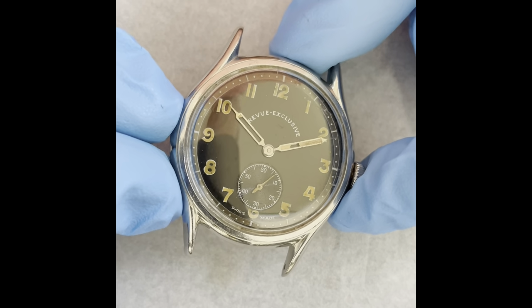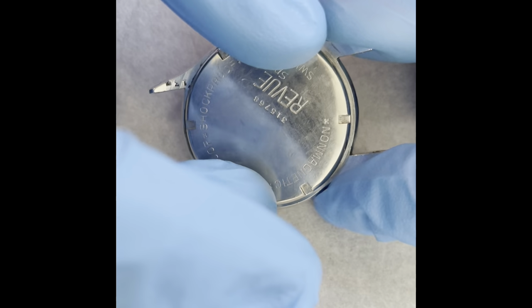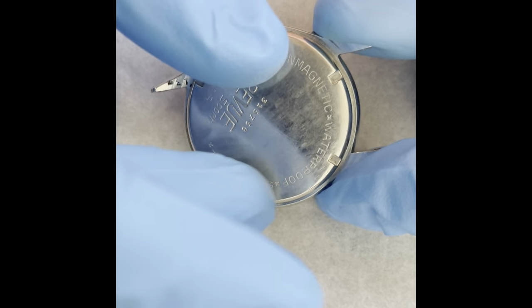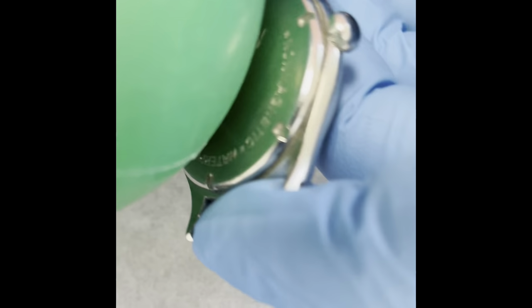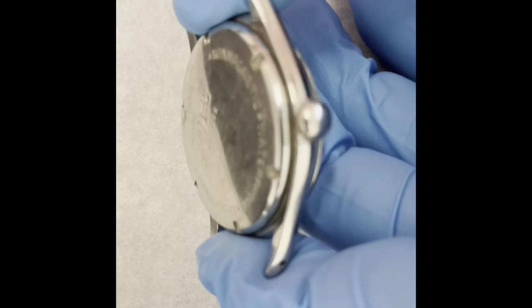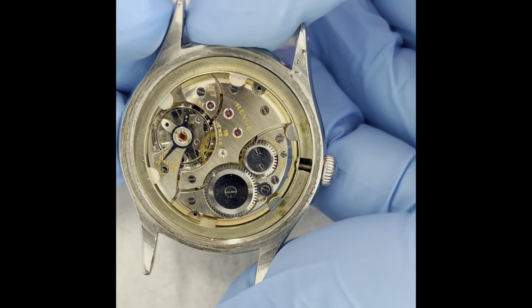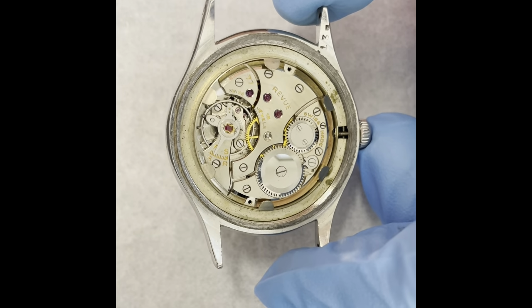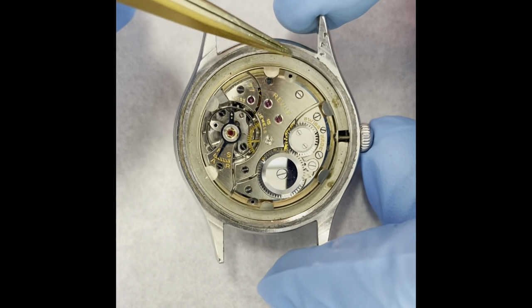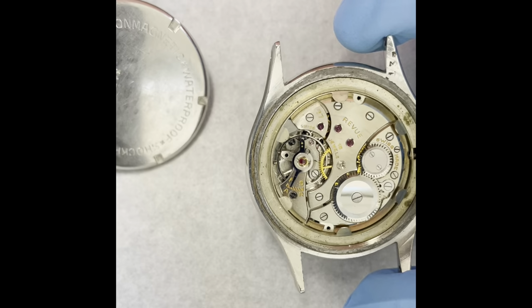They came out wider a bit later on with the calibre 81, or around the same time, but this is a calibre, I believe, it's a calibre 77. Let's open it up and have a look. Yep, there we go. That is the calibre 77, and it has an extra wide movement holder rim to keep it in place. You can see that here, and it's in a very solid stainless steel case.